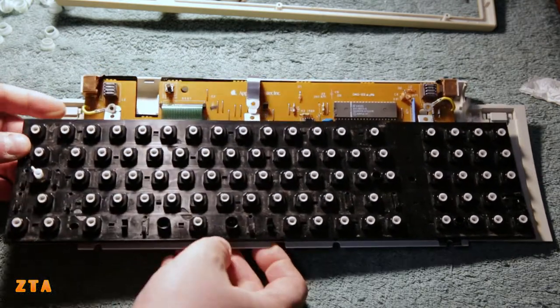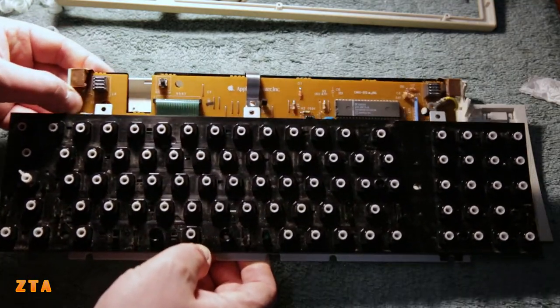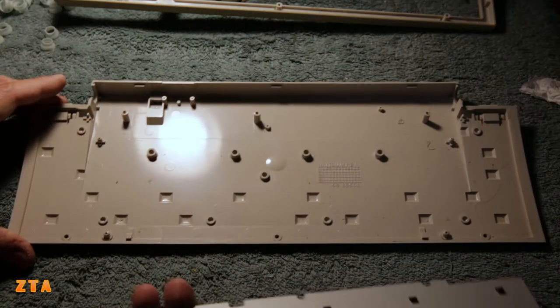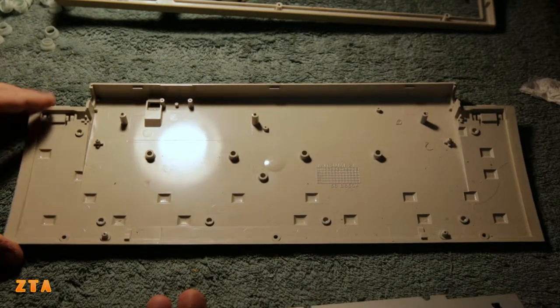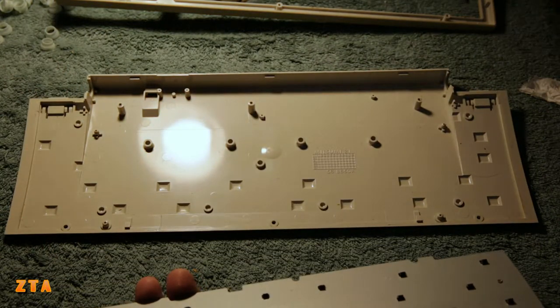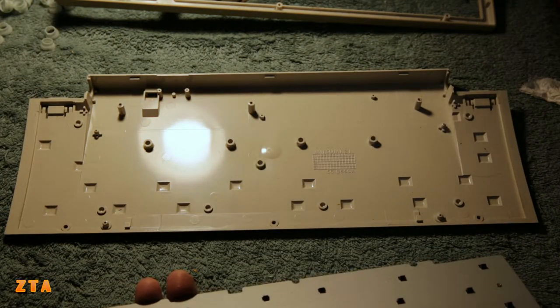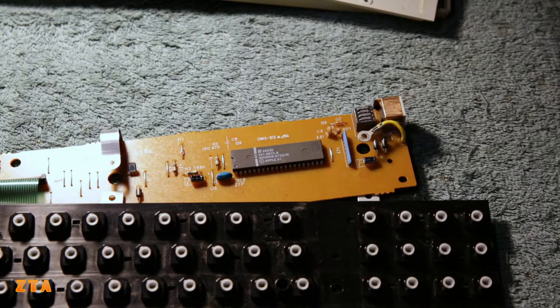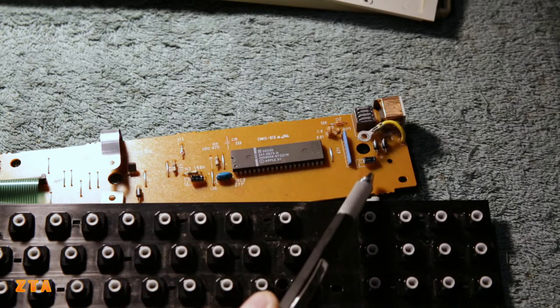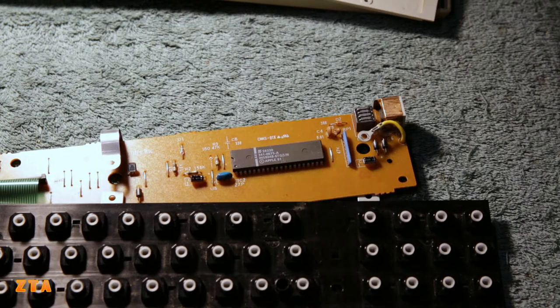So the back comes off here. You'll see that there's a shield there. We now have all the plastic pieces basically separated apart from electronics, so we can do more cleaning and whitening. And what do you know - I did find two electrolytic capacitors, these tiny ones here. They're one microfarad each, so they'll have to go. I have to change them.